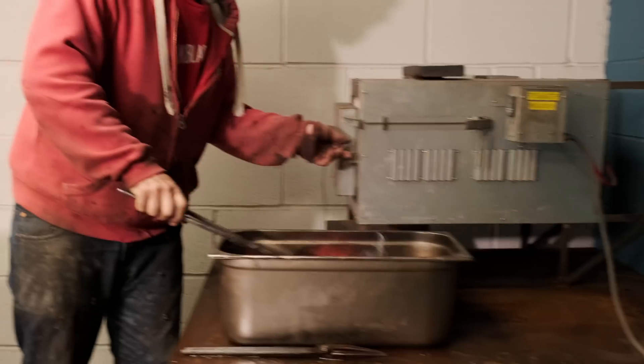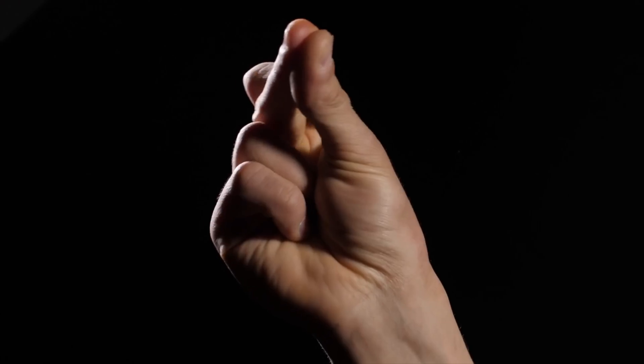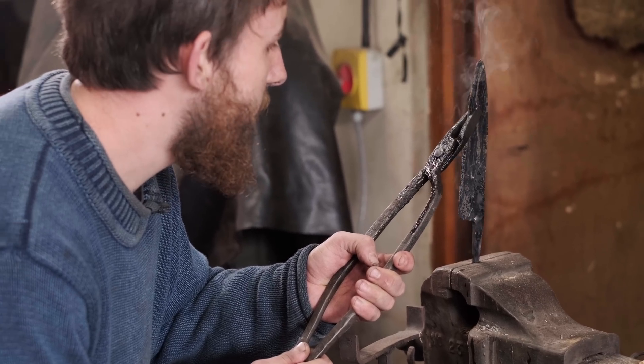If the temperature is too high, your crystals are getting too big — too large for the recommended size — so when you quench them, yes they'll come lovely and hard but they won't have the ductility that you would hope for. Ductility might sound like a strange word when you're talking about a hardened knife, but it does make a difference. If the grain size is correct you're going to get the ultimate properties out of it. Getting the quenching temperature right is critical, and you need the same temperature over the whole blade so that when it quenches it all reacts properly.